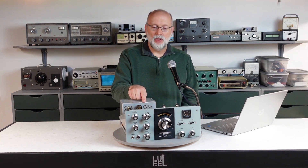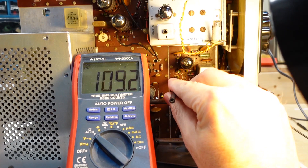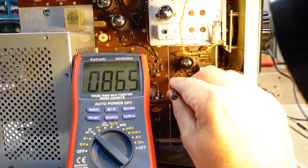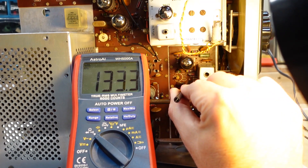Now for the transmitter alignment. The first three steps went just fine — setting the tube bias, adjusting transformer T1, and even the preliminary neutralization all happened without any issues. Unfortunately, I ran into a snag when I tried to set the carrier null. The issue is the 200-ohm carrier balance pot is toast. I checked it back in episode 2 when I said I checked all the pots and it tested okay then, but I guess I was mistaken or it was just lying to me. It's badly erratic now, so it'll have to be replaced. They are a common failure point on these Heathkits, and there's no modern drop-in equivalent replacement. The best modern-day solution is to cobble in a 10-turn trim pot — I've had to make that exact same repair on my SB401 for the same reasons last year. I don't have a spare in my stash, I've ordered one, but until the part comes in, progress on this project is on hold.